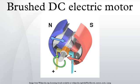Its principal disadvantage was that 3 machines were required to implement a scheme. In many applications, the motor generator set was often left permanently running, to avoid the delays that would otherwise be caused by starting it up as required. Although electronic controllers have replaced most small to medium Ward-Leonard systems, some very large ones remain in service.